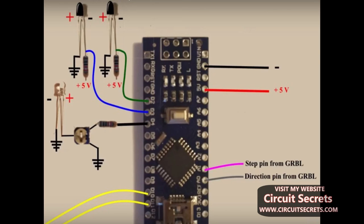At the desired position, the H-bridge is given a stop command — both control pins are set to ground. This acts as a brake by shorting the windings to ground. A spinning DC motor generates voltage and current through induction as the windings move past the permanent magnets; shunting this energy to ground increases the mechanical force needed to move the coils — similar to how regenerative braking works on electric vehicles, except there the induced current charges a battery. For a DC servo with a worm-gear reduction motor, the motor is essentially locked in position when not powered.